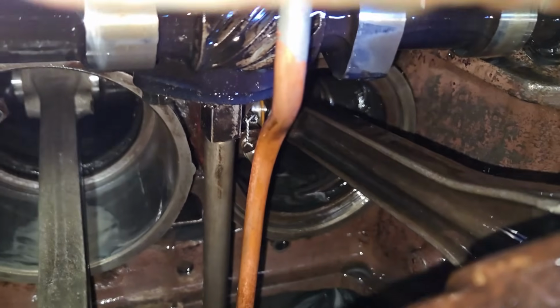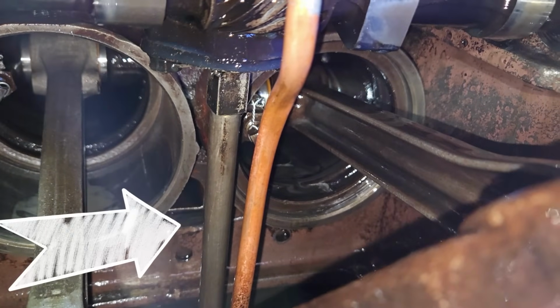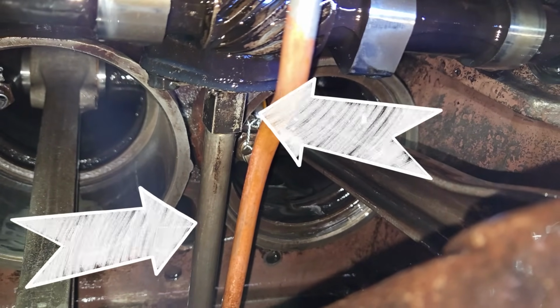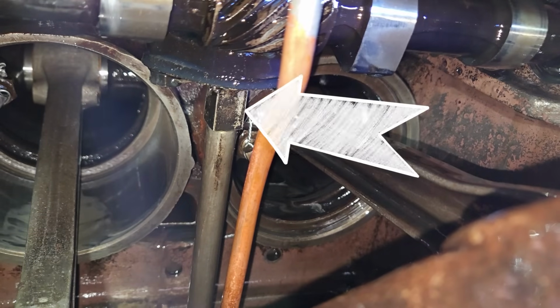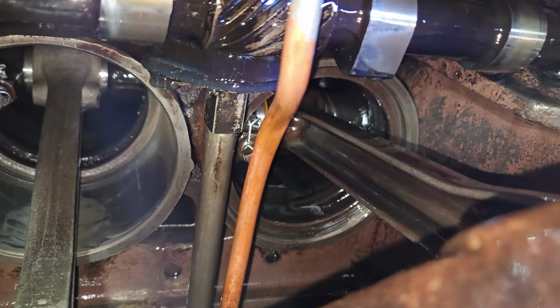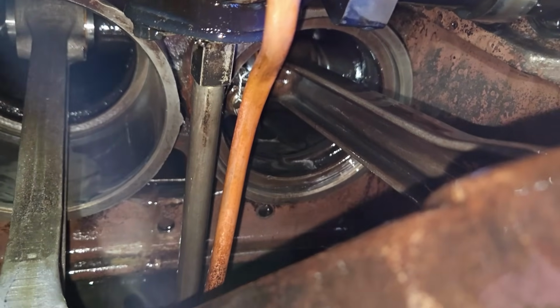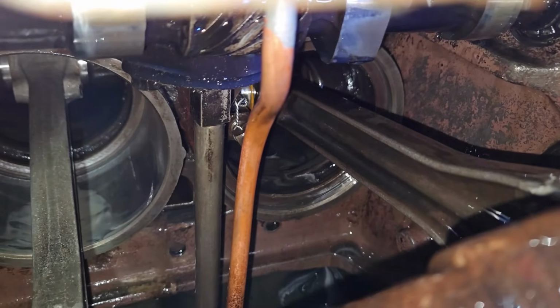You can see there's a vertical shaft, and there's even a square coupling up at the top. That's a drive shaft between the governor that drives the oil pump. And so that square coupling, if that breaks, you lose all your oil pressure instantly. But the oil pump is actually down there in the bottom. It's submerged down in the oil, and it drives off of that vertical shaft.